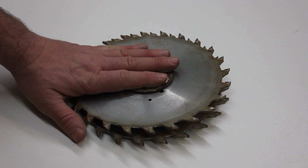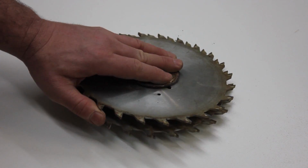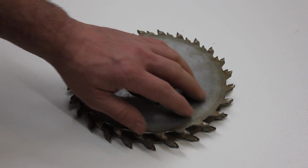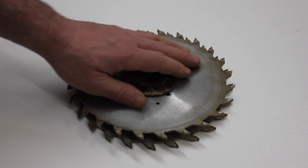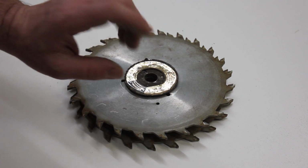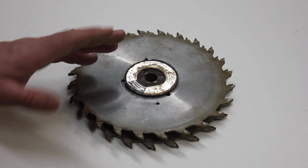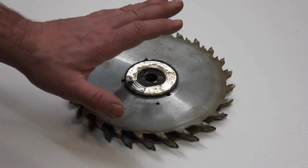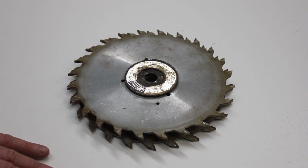Now you don't want to use this kind of dado. This is a wobble dado, and it's not recommended in your SawStop. It may not engage correctly with the dado brake cartridge. Also, don't use molding heads or sets with solid plate interior chippers, as neither brake cartridge is designed to stop those types of dados.